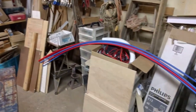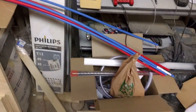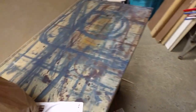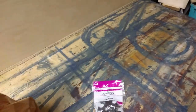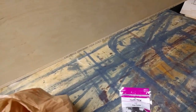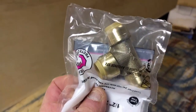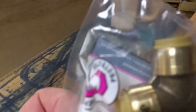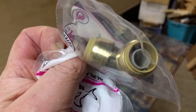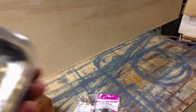And I went and got all my plumbing. It's going to be all done in PEX with Sharkbite fittings. Got some nice hangers to keep it nice and tight. That's what a Sharkbite fitting looks like — basically you cut the pipe to length and you just push it in and it locks down. It's supposed to be leak proof; first time I've ever used it, but we'll find out.